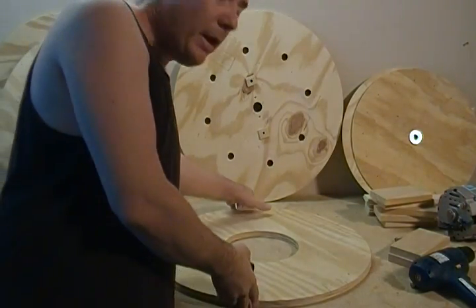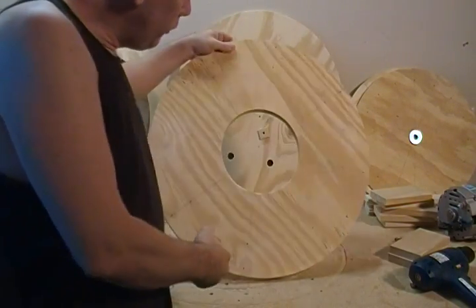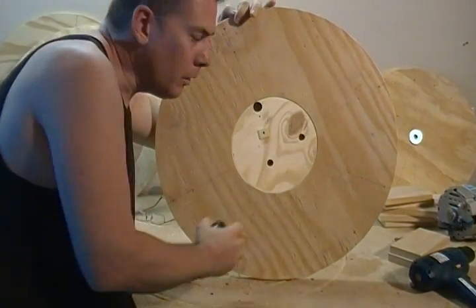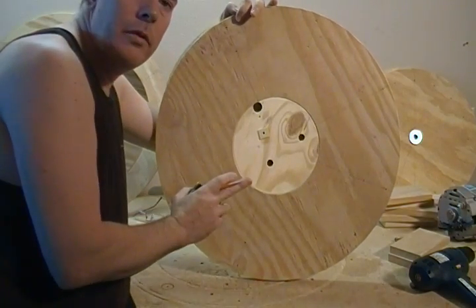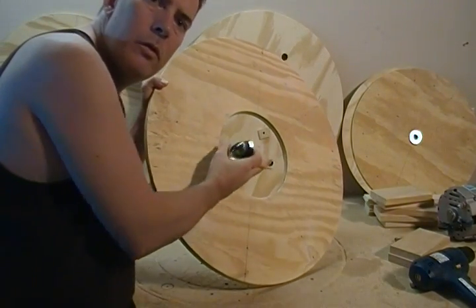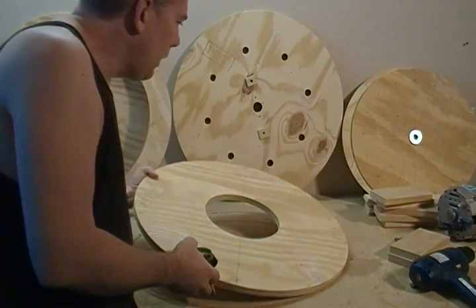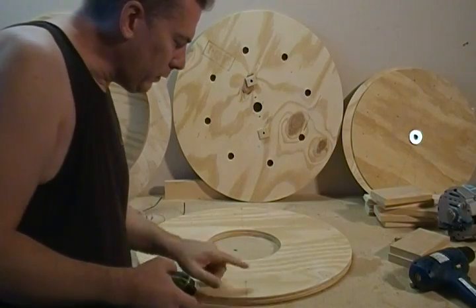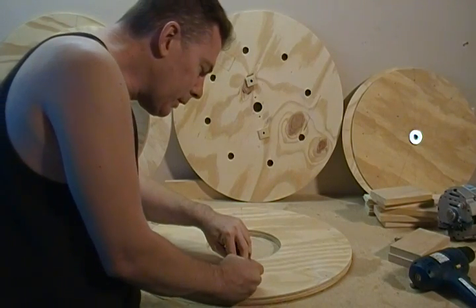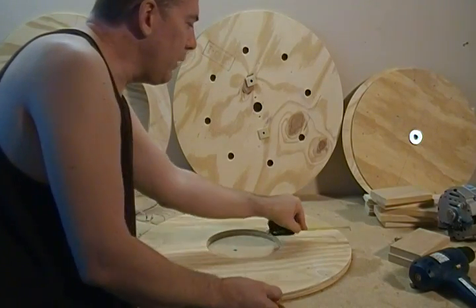In this operation we're going to take our base ring and measure. You should have eight sectioned out lines on your ring. We're only going to do this in seven places because we want an opening for easy access to our alternator or DC motor, whatever you're using. We're going to measure three-eighths and then two and seven-eighths from the outer edge, and we're going to do that in seven places on those lines.